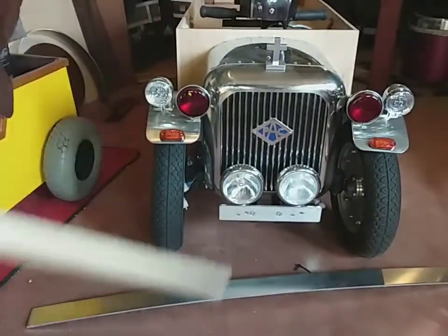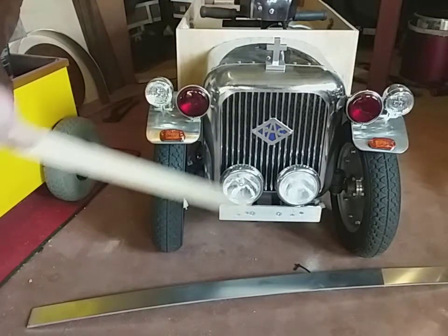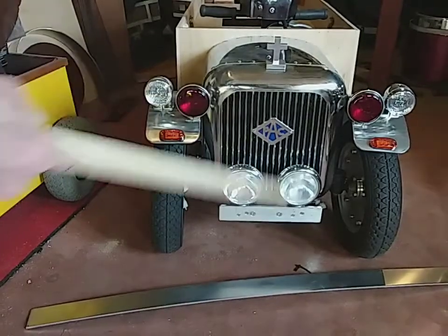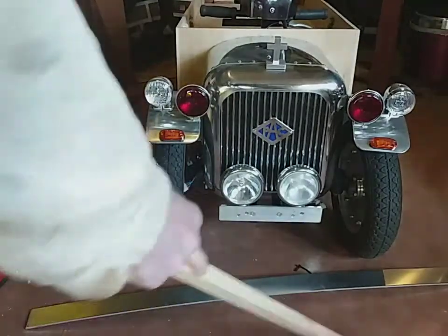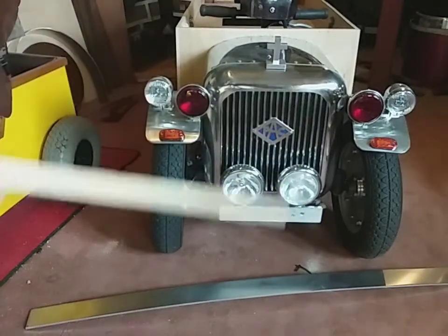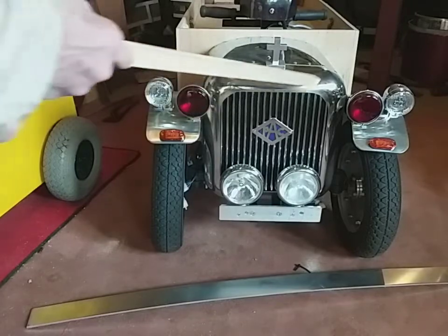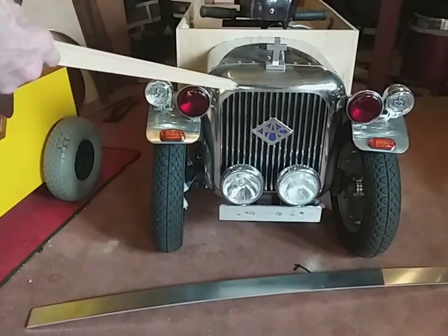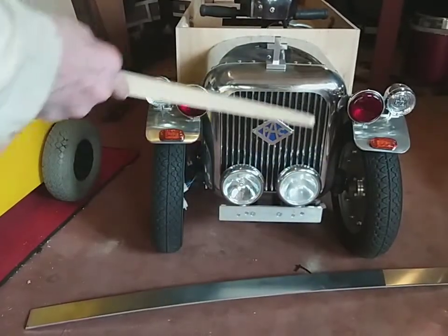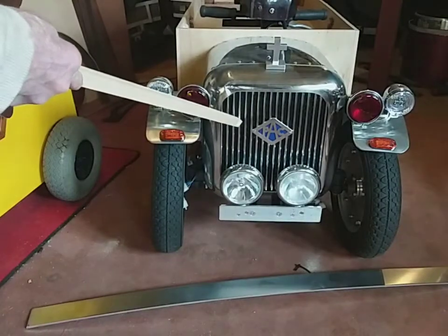The mesh at the back is off of an ironing board. These bars — I've got some of those barbecue-type racks from the boot fair, cut them up just to get the metal. I've used a strip of metal at the top and the bottom, drilled holes in it, and then welded it at the top and the bottom to make the actual grill.